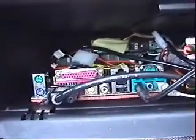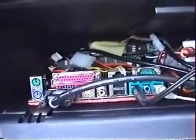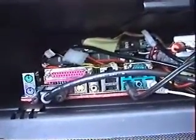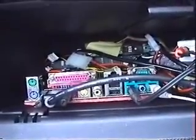And in fact, on another one of these same boards I've got in my house, I've removed the fan heatsink and stuck on my own larger passive heatsink, and so it's a totally silent system, and I've had it running for over 2 weeks now non-stop, and it's not had a problem, so that's a solution if you want to try that. Okay, now one of the main reasons I've managed to get the entire Carputer into this glove box is because of the power device.